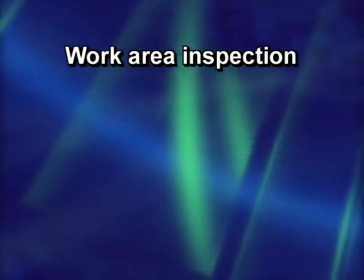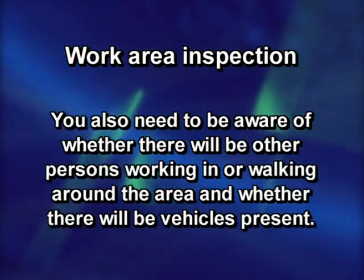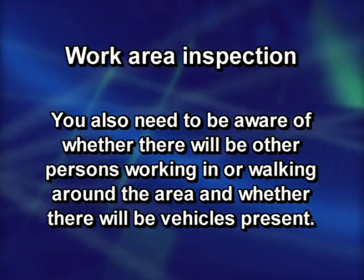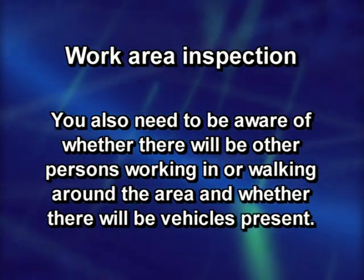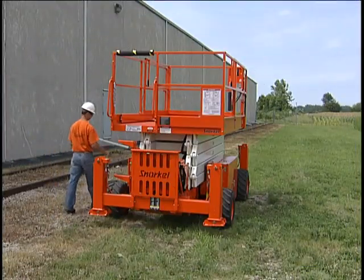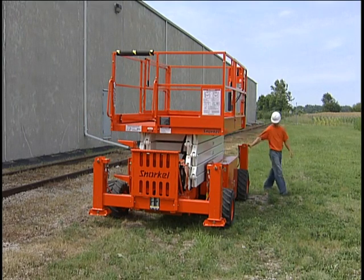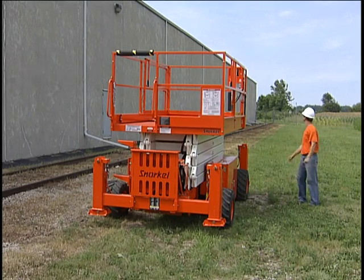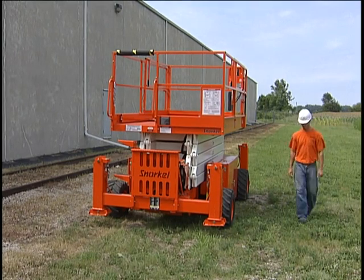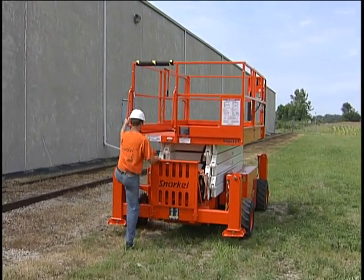The other phase of your safety inspection is inspecting the area where you will be working. You will also need to be aware of whether there will be other persons working in or walking around the area and whether there will be vehicles present. You need to check for electrical hazards, tipping hazards, hazardous and flammable materials, and anything overhead that the platform could run into or cause a head or crushing injury to the operator. Outdoors, be aware of wind conditions that could create a tipping hazard.